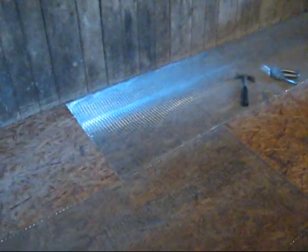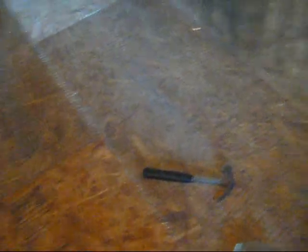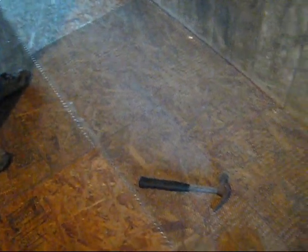Today we're starting to prepare the floor for tile. I've got my flooring buddy here. The subfloor is down — we finished screwing down any spots that were bubbling up. Now we're putting down the mesh. All you do is put a staple every foot just to hold it down until the mortar grabs and everything is solid.